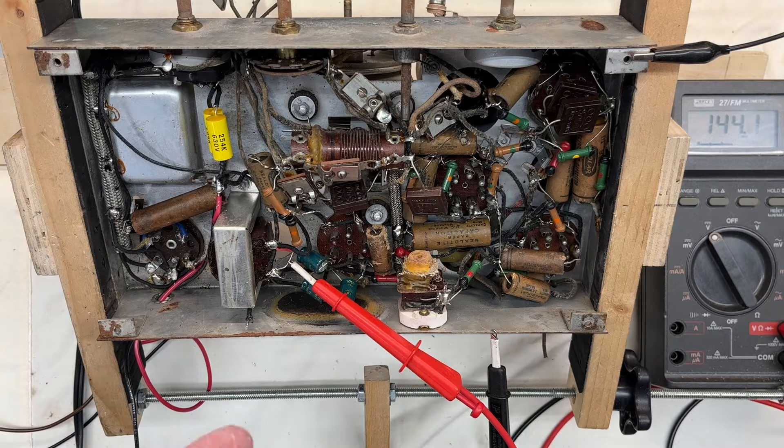Let me show you guys what I did for the synchronous vibrator. I'm gonna flip the receiver around and I'll show you a preliminary view of the circuit that I used to bring this up. You probably already realize by now it's solid state in lieu of the old mechanical vibrator, because you don't hear the clicking noise in the background.